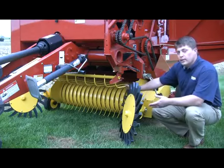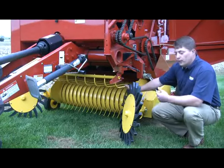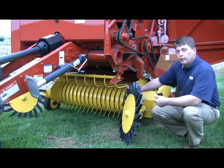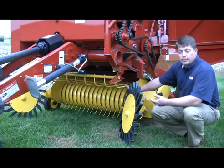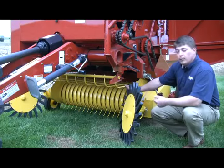The pickup is 44.7 inches tine-to-tine and 61 inches flare-to-flare. The 4-bar pickup has 72 tines with 2.6-inch spacing, which means the tines are going to be 15% closer than a Vermeer. What that helps with is picking up your hay very cleanly so you're not leaving anything behind in the field.